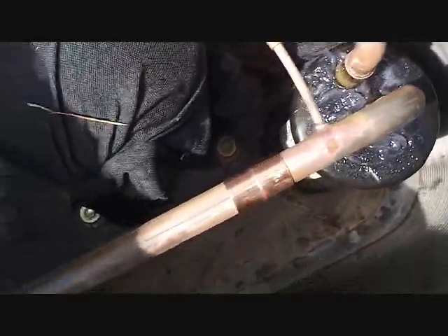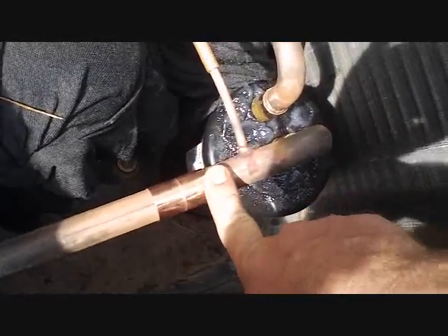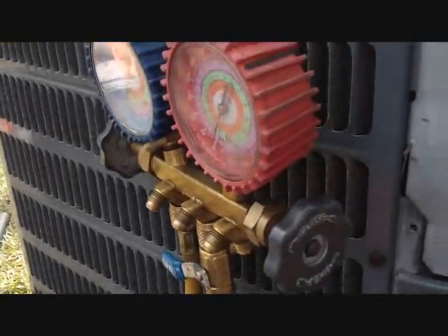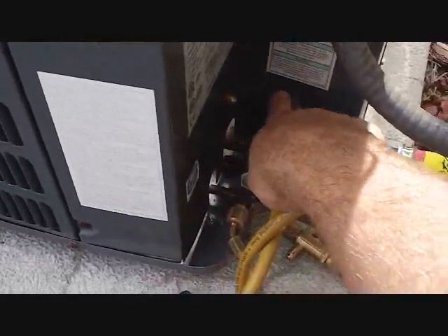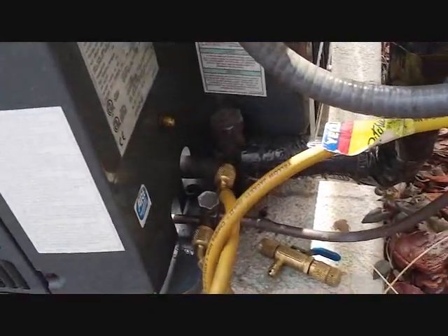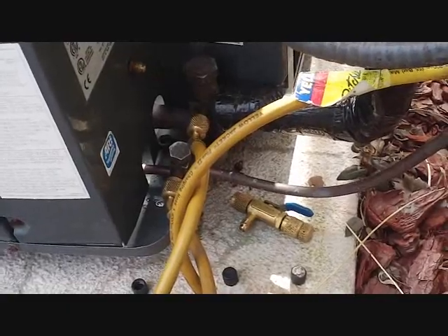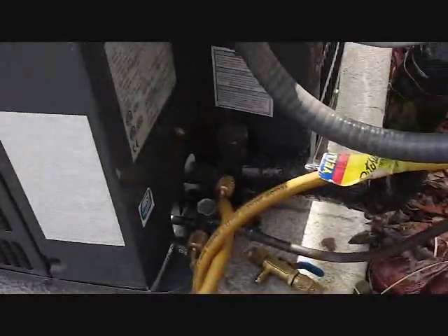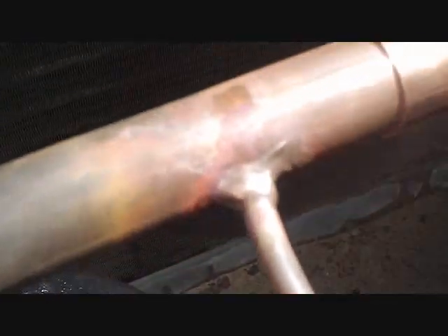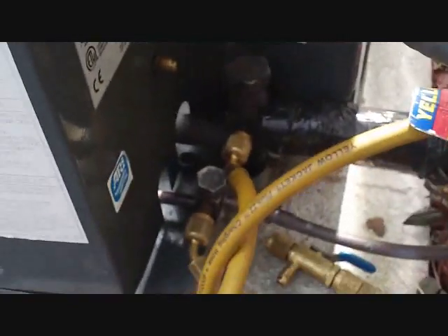We've got everything set up — the accumulator sitting in there with a little heat trap on top so we don't mess up the paint. Couplings on the outlet line to the compressor and on the inlet from the reversing valve. We sleeved the sampling tube and heat charging port. We're about to open up the nitrogen and braze her in. We're going to send the nitrogen through the gauges into the low side, forcing it back through the heat charging port exit and the high side — two exit points so we get free flow and no buildup. I also beefed up the heat charging port because I've seen a few of them break off, so I re-brazed it in a way I could be more confident in.